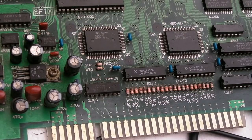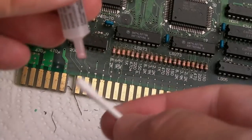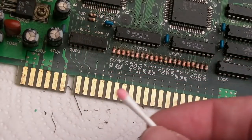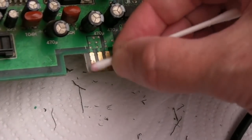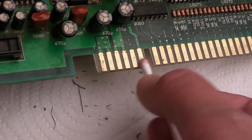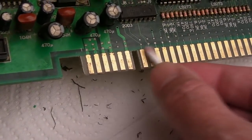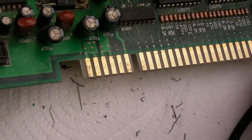Somebody has gone, I'm going to consolize an MVS, you know. Oh, I'll use a 2-slot, use that at home, or I can play my cards on it. They just left the battery on it. It's crazy. If you're going to get into Neo Geo stuff and arcade boards, please God, remove the batteries. And if you're really bothered about your high score saves and things like that, you really want a battery, fit something externally, put some wires to where the battery is, and route it to a battery module, you know, a meter away from the thing inside the cabinet or something. Or do a CR2032 mod.